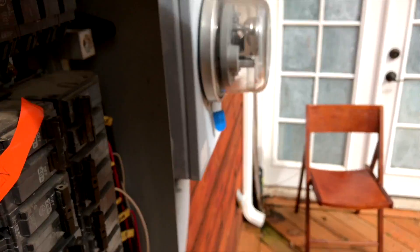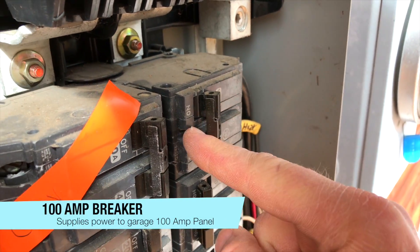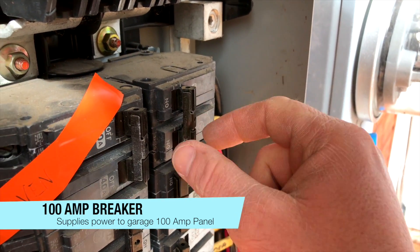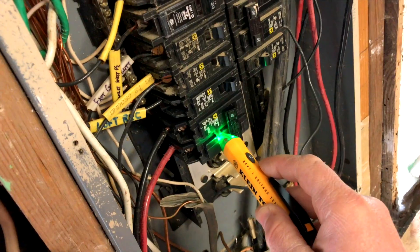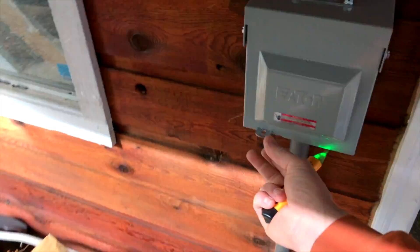Okay, we're back at the main panel, and right here is our 100-amp breaker. We're going to close the breaker, re-energize power back to the garage, and let's see how this breaker stays on. Lights are on, that's good, and we should now be hot. Our new 50-amp breaker is still open, so now we're going to close it. All right — hot, hot — let's go up to our panel and give it a check.